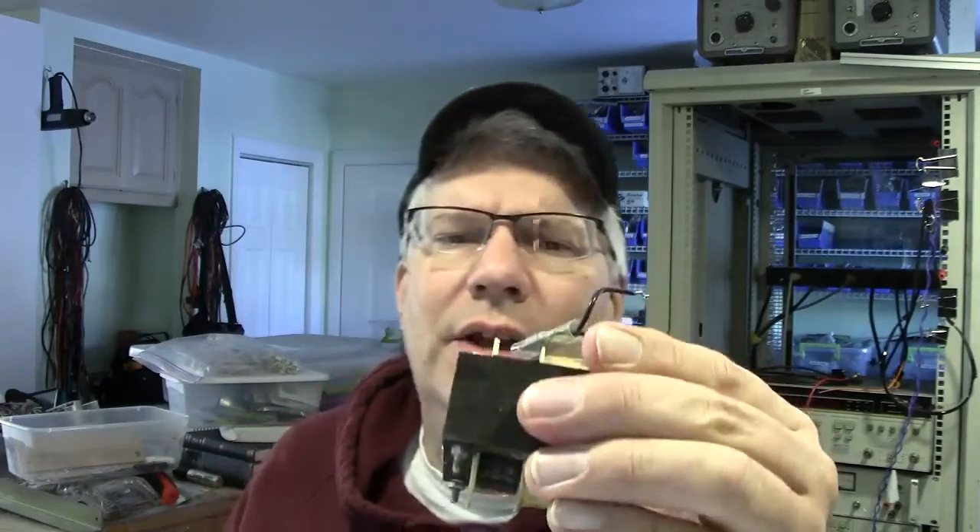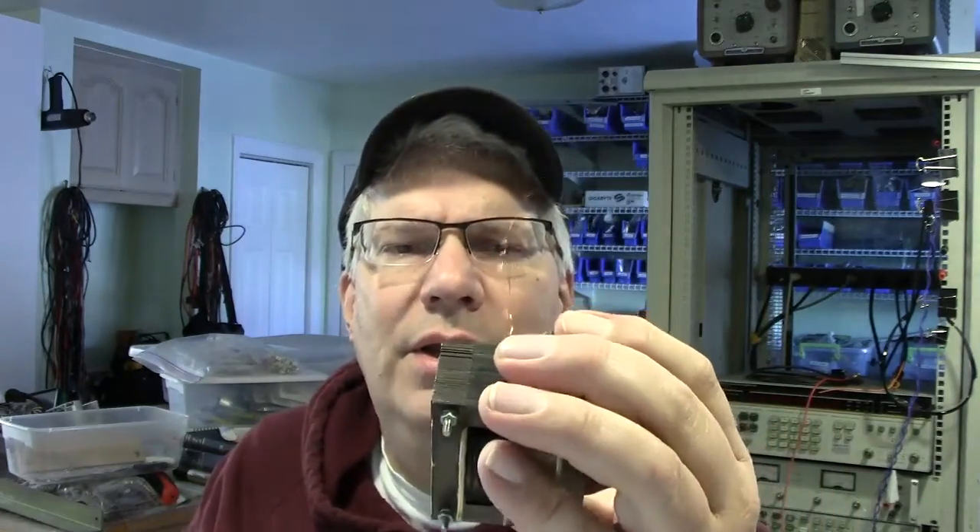You can do it, but it's not that pretty and not that precise because the wires overlap on top of each other. If you really want to get into output transformers, high-performance designs interleave the primary and secondary windings. For example, say you had 300 turns on the primary and 50 on the secondary — a high-performance transformer would wind 50 turns on one layer, then some secondary, then primary, then secondary, interleaved throughout.